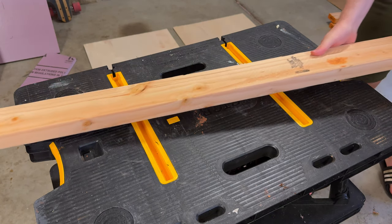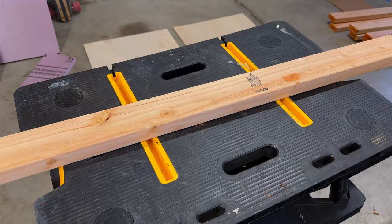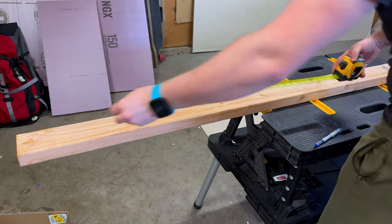If you don't have something like a nail gun or even a staple gun with the brad nails, you could just use nails and a hammer. That's pretty much all you're going to need for this. So let's get to the project. The first thing you're going to want to do is actually take the measurements of what you want. The dimensions of the stand that I'm making is going to be 48 inches tall, 40 inches wide, and 14 inches deep. But you can adjust those measurements however you want. The first thing we're going to do is take one of our two-by-fours and use a tape measure to measure to length. In my case, this is 48 inches.